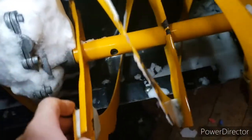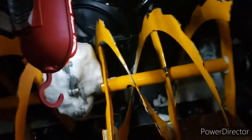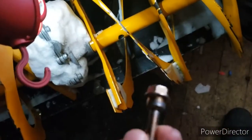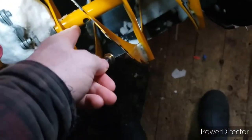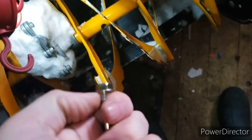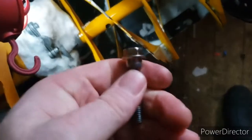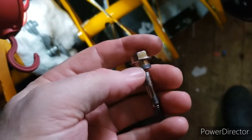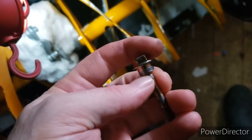What you want to do is line up the hole, tuck your bolt through, and tighten it up. As you'll see, it's got a big shoulder that goes in the big hole. What happens is the auger is set up so when it's turning and it jams, the auger is going to help snap the bolt right at the groove, because that's the weak point — and that saves you from more serious damage.